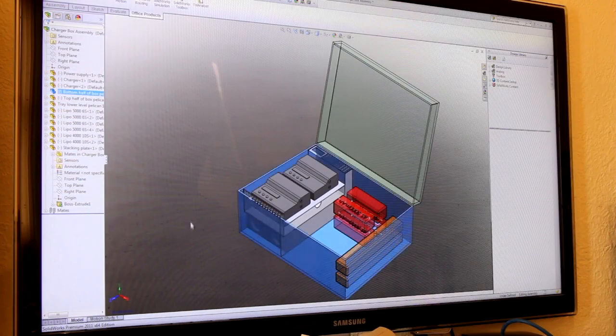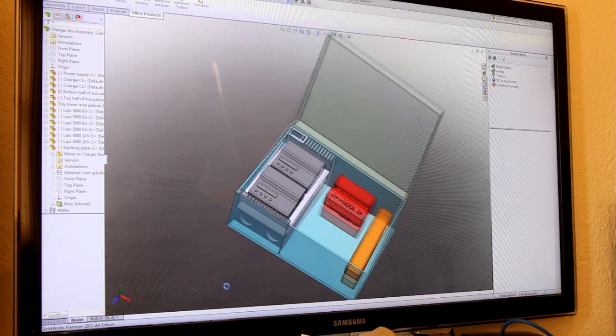When I set out to design this LiPo charging station, I put all the individual components into a CAD program just so I could get an idea of what size box I wanted to fit all the LiPos, chargers, power supply and things like that. Another main factor I considered was easy assembly and disassembly, so I chose to secure everything inside the case with Velcro. I also put board connectors on all the electrical connections so you can really easily disconnect and reconnect them if you need to get inside.